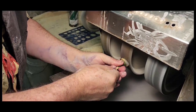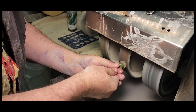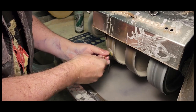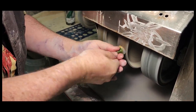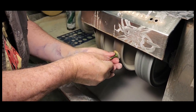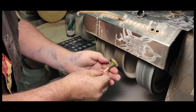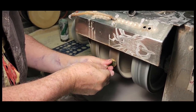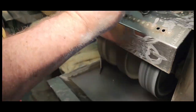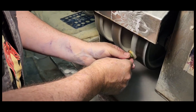Still have a little low spot — work the whole rock, not just the low spot. We want this so flat it will hold onto the wall. If it's really bad, you can take some out here, then come back and make sure you get rid of all the grit marks you just created. Don't push hard — if you push hard we'll only do the outside edge and miss the center. Try to use your whole wheel, not just one area.